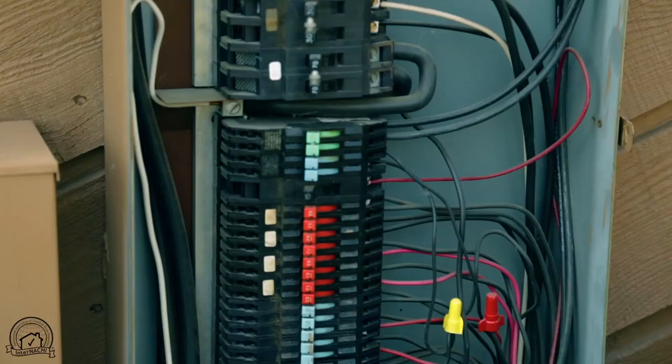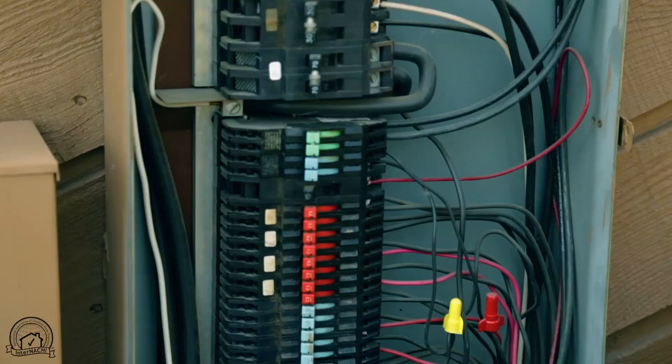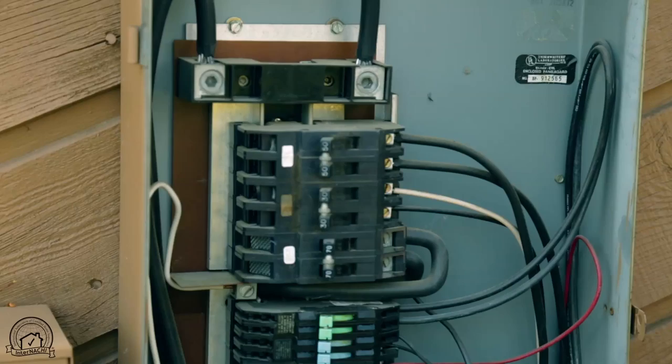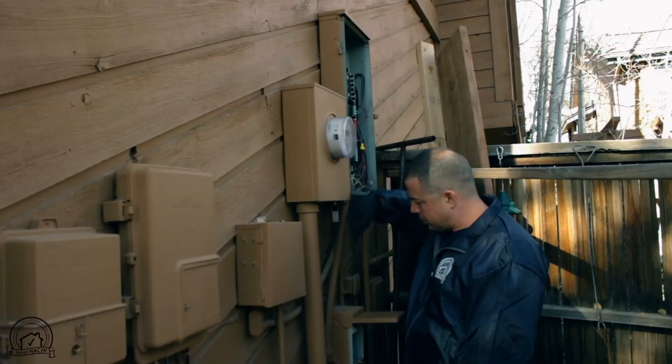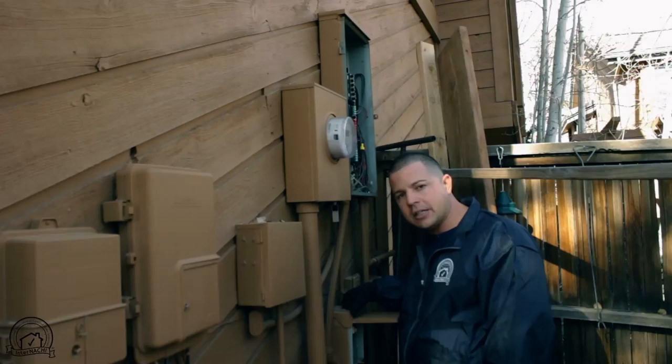Make sure there's nothing live out there. Check the breakers and what brand the breaker is. Check other training videos from InterNACHI where we talk about the four-point report that really goes into the electrical system, especially for insurance purposes. We want to check the panel, all the wiring, the breaker, and the fuse here for the AC system — everything detail by detail. So we've covered some of the outside inspection. Please follow me inside.